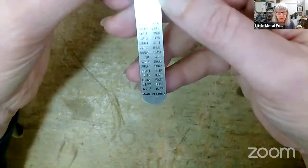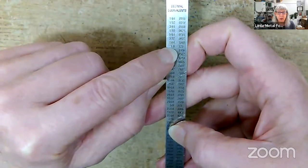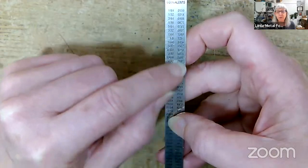To find the center of a circle, I also need my stainless steel six-inch ruler, which has millimeters and inches on the same side. The back has decimal equivalents for inch fractions — so 1/8 is 0.125 — which can be really helpful when ordering machine parts. We're in the US where we still have imperial measurements, so having that conversion handy is useful, though I don't use inch fractions as much.